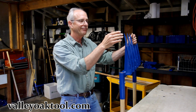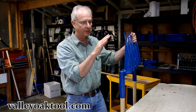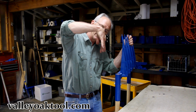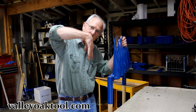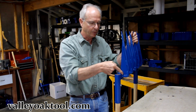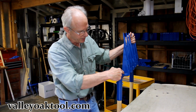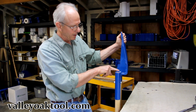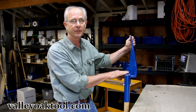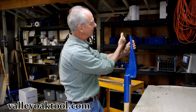So if you have a steel like this, you need to somehow reinforce it so that it doesn't bend, because if the tines bend and they're like this, instead of all being in the same line, if one of them's off and you try to shove it in the ground, it's going to resist and you have a tool that really doesn't work very well. So that's what the gusset is for, and we welded it in three places here on each side. And we also made a special notch out here so it's got really good adherence to the tread bar. We made the tread bar nice and thick. All this is to make a really stiff tine that will keep its alignment. You want them all to be right in the same alignment.